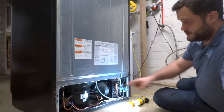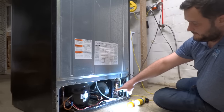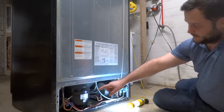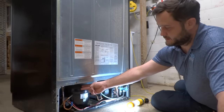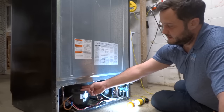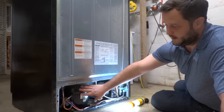What you see back here is your compressor and your condenser fan. That fan, if it's spinning, is typically on the same circuit as your compressor. So if you see that spinning, your compressor should also be on. What you want to do is touch the compressor — just touch it lightly. It may be hot, so be careful, but it's not going to be super hot. If it's cool and you don't feel it vibrating at all, you probably have a compressor that's not turning on.